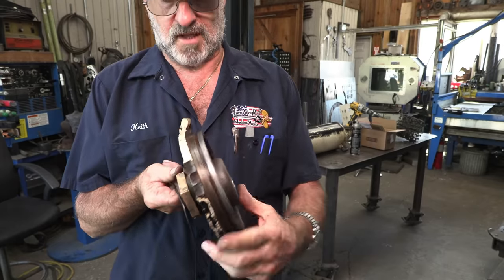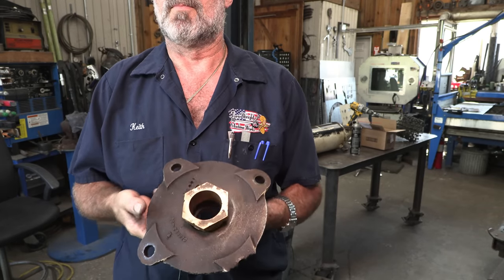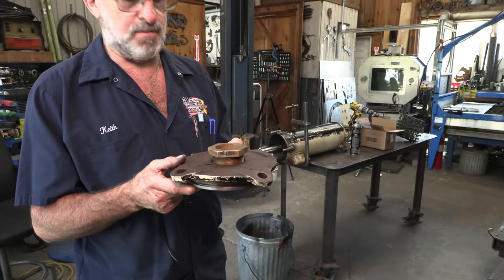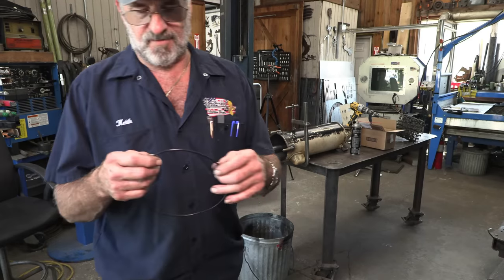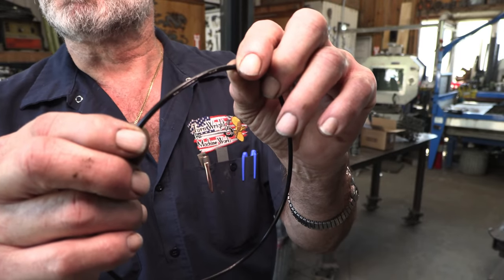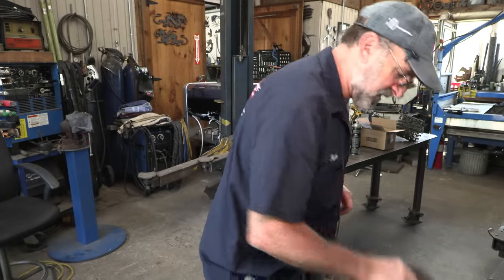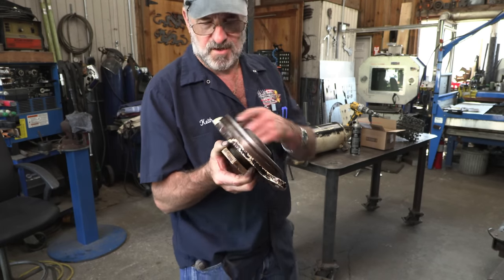Okay, this is the old cap. This O-ring goes around in here and makes a seal. This was over tightened because somebody was trying to keep it from leaking, and then it ended up breaking a stud, and the cap ended up flying off. Okay. Let me see if I can rotate. You see the chewed-up spot right there on the outside part of that O-ring? That's the leak. The fix is changing the O-ring, not tightening down the cap. You can look at the cap and know that the O-ring is the seal, not that surface right there.